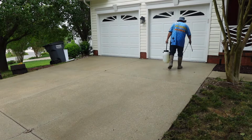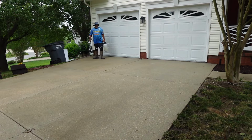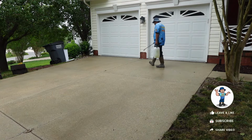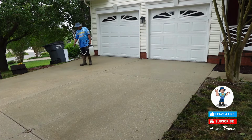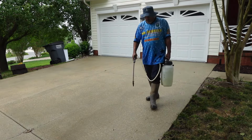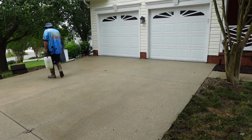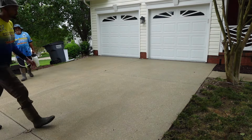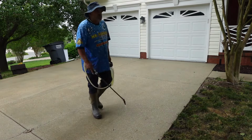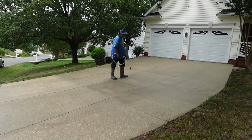And so once you've rinsed off all of the dirty water all the way to the curbside, you want to post-treat it. Now, we, Mr. Bubbles, post-treat it with a company solution that we make in-house. We call it Goofy Juice. And all it is really is a concrete brightener. But what you guys want to do is, if you don't have anything like that, get yourself a pump sprayer. The pump sprayers that we order on Amazon, and the link will be down below for that. But what you want to do is put your company house mix, whatever your house mix is, 4%, 5%, whatever you use as a company, put that in your pump sprayer and pump spray that.